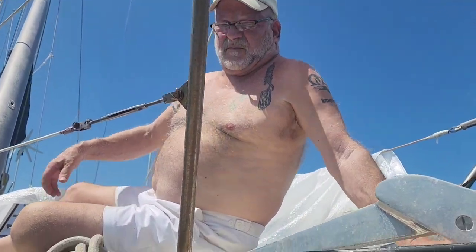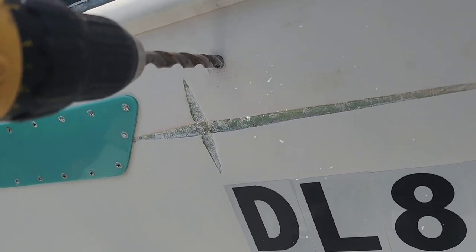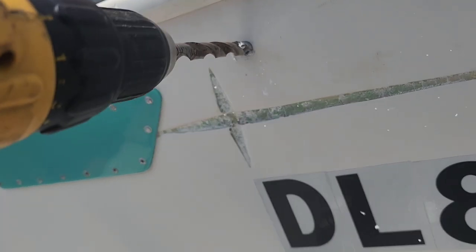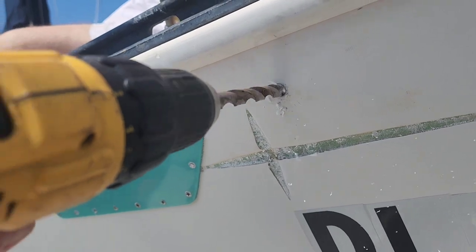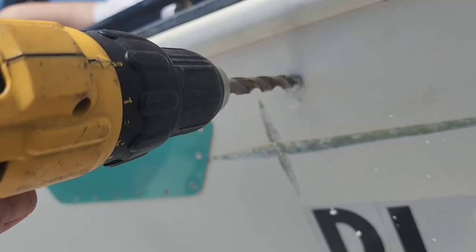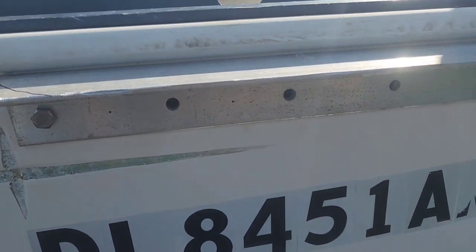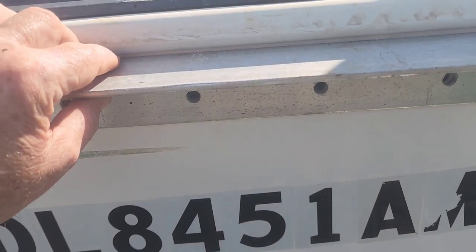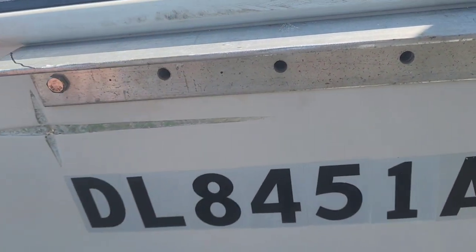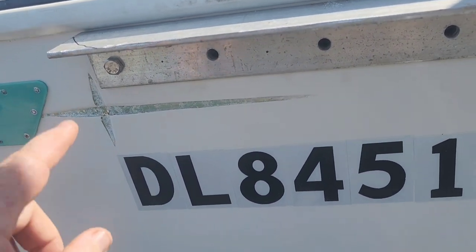I'm drilling more holes in the boat right ahead of our CNC star. That's a lot of fiberglass here, let me put two hands on it. This is how this is going to look - that's two-inch structural angle we're going to bolt to the side of the boat. You can see it's not square; of course nothing on the boat is square, so we're going to buy some plastic wedges that we can drill through that'll be good, solid, and level this up.